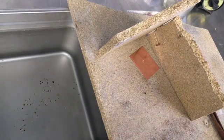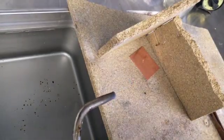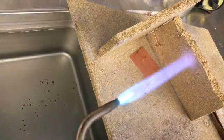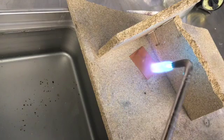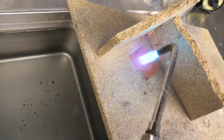A really beautiful patina can be made on copper by heating it well beyond its annealing point while starving it of oxygen. The results are streaks and blotches of intense reds, golds, oranges, grays, and blacks. Because this happens at such a high temperature, you can't do it on anything with solder joints, and it will be very well annealed, so it's not a good choice for fragile pieces.